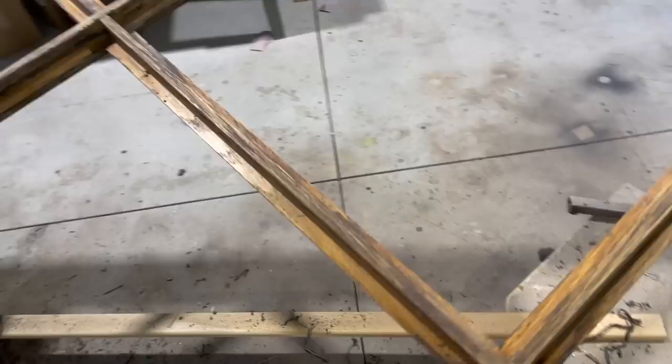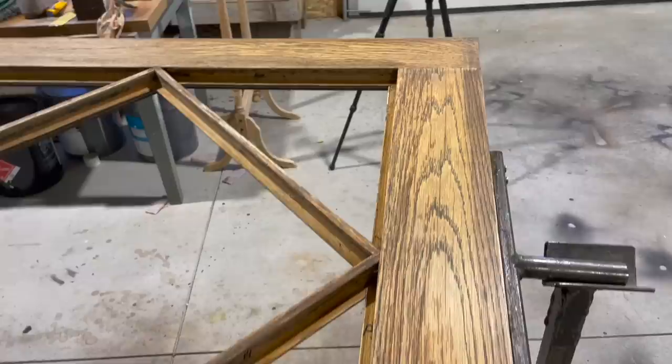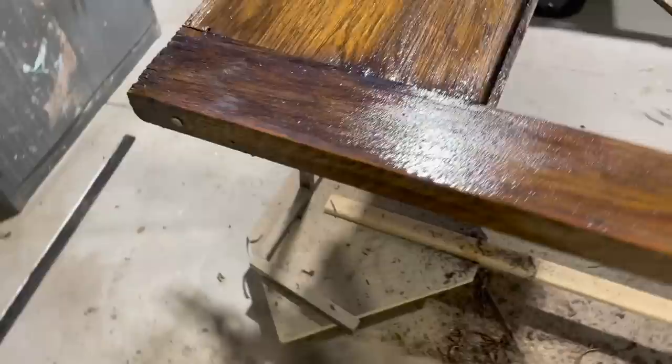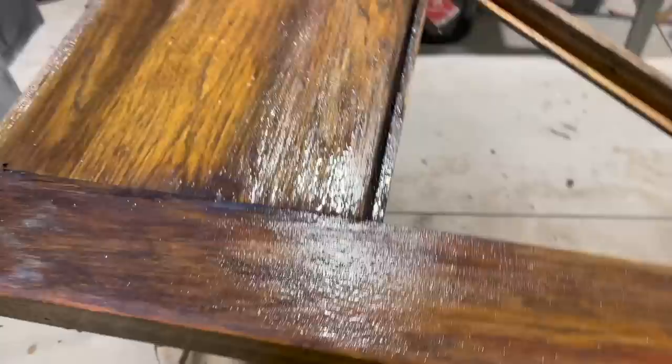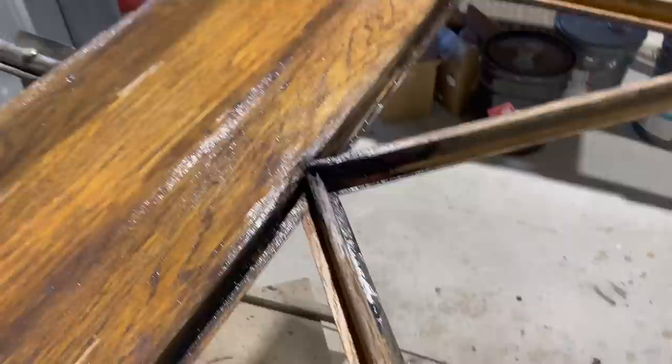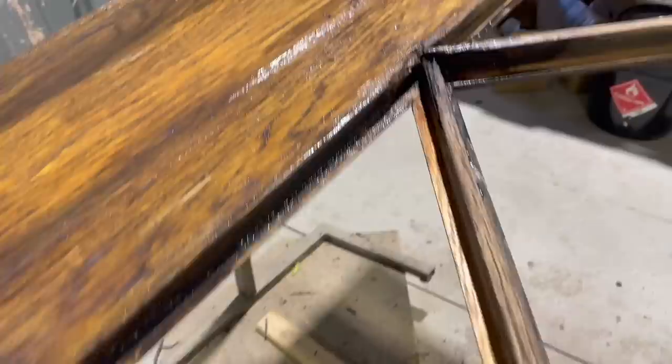Anyways, this is supposed to be the inside of the door, and it's really not meant to be out there, so it's taken a beating. We've got rotten wood all along here, and this point here is really bad. So all of this stuff that I've got here, I'm soaking with the wood hardener. You can just buy it in Canada at Home Hardware. It's just rehardening a lot of the wood that's really punky and soft, and then I'll have to do some epoxy work and filling, and this will have to go back on the inside because this is really not meant to have weather get to it. So I'm just gonna let that dry overnight and be back at it tomorrow. Got quite the mess going on here.